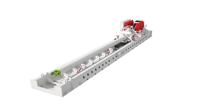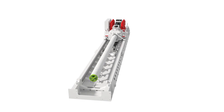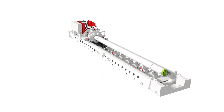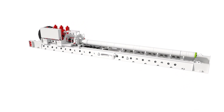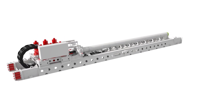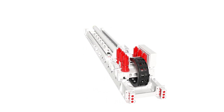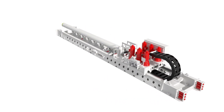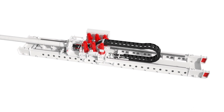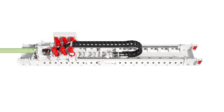With the ePowerPipe technology, protective pipes with smaller diameters can be installed quickly and safely underground with drive lengths of more than a kilometer. The trenchless method is based on proven microtunneling technology and allows the efficient installation of individual cable protection pipes, taking into consideration all criteria with regard to cost-effectiveness, safety and construction time. The ePowerPipe method involves three main components: a jacking frame, the tunneling machine and jacking pipes.